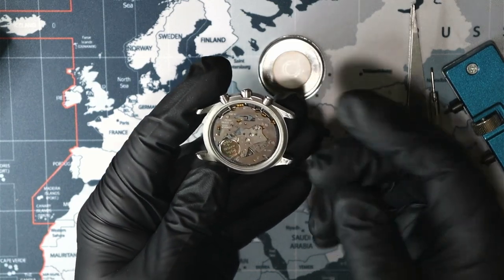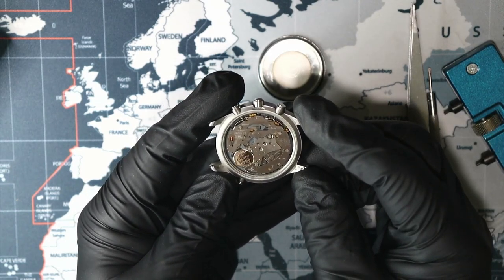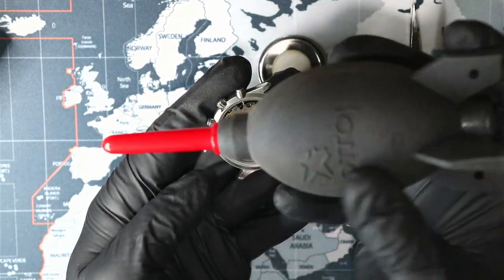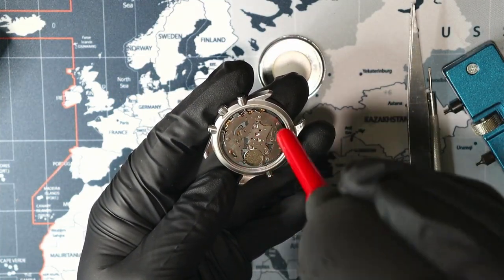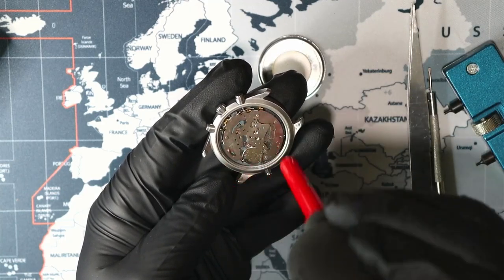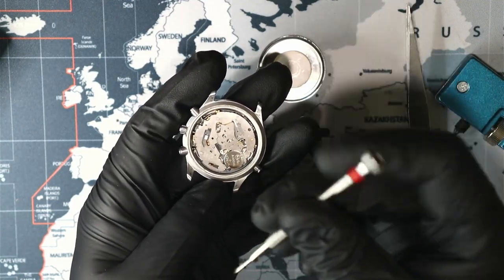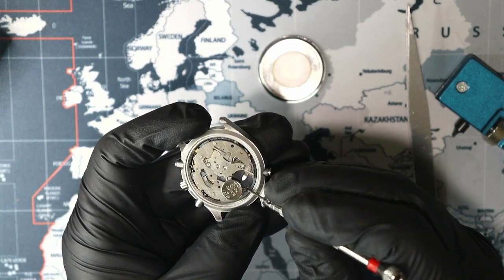You definitely don't want to do that. That's why you either wear rubber gloves or finger cots — preferably the clean ones. Now we're going to make sure that we didn't just drop some gravel in here. I have this little Giotto blowing ball that I use for camera cleaning, camera equipment, lenses and stuff. They're pretty good — you don't need an air compressor when you're working on watches. So we can blow this off a little bit in case something fell in from the case back. And now we're going to use a tiny little screwdriver also from this Amazon toolkit, and we're going to take the battery out.